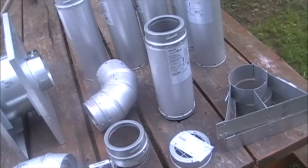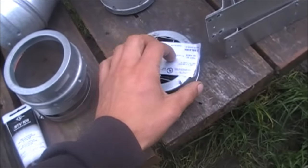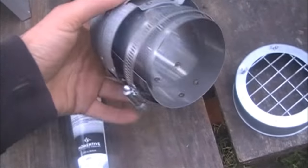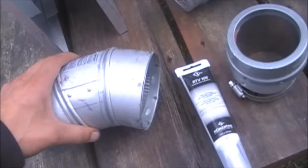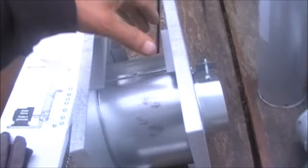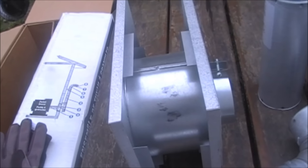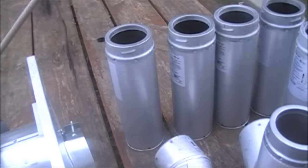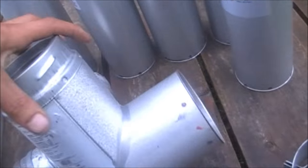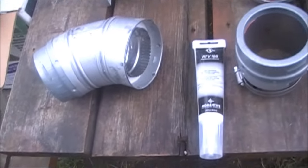Just a quick overview of what you get in the kit. These are the two braces for the wall outside. This here is the cap that goes on the end of the pipe — it just blocks birds and stuff from going in. Then this is the collar with the three-inch that attaches to the stove. Here's your 45. Here's your wall slot — it expands to go to the thickness of your wall, which I might have an issue with because this is a log home and I think the walls are almost 15 to 20 inches wide. Then you get the five pieces of straight length, your clean-out, this is your T with a clean-out on the bottom, and then a 90-degree elbow, and a tube of silicone.